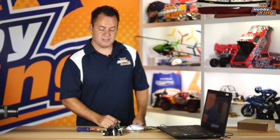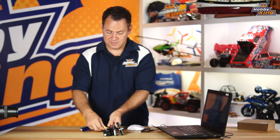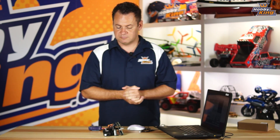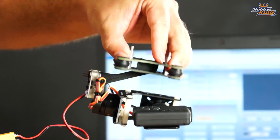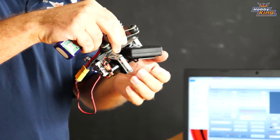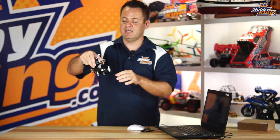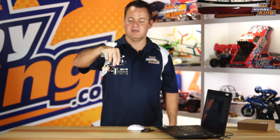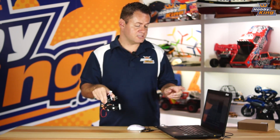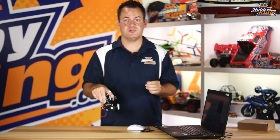We're all set. You can play with the two different software versions. Close the software, disconnect, and cycle power on the gimbal. Give it a second to initialize the IMU — and there you go: silky smooth Mobius. Key notes: we've changed the IMU position on the bottom to go toward the motor, and switched the motor wires, which allows the cable to pivot forward instead of on the back side, making it much more flexible with no cable binding. As for the software, it's loaded under the files tab — just download which one you want and make sure you click write settings to flash, otherwise it will not remember the settings. Good luck, guys — get some great aerial photography and subscribe to the YouTube channel.